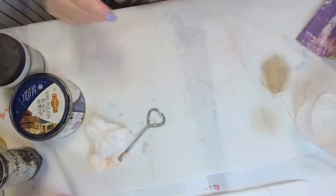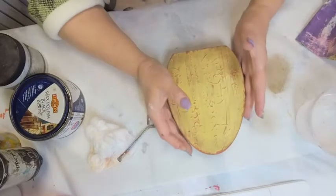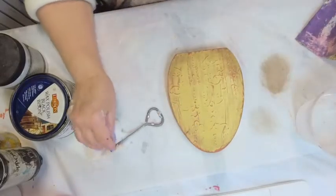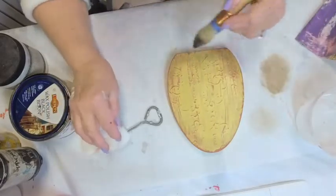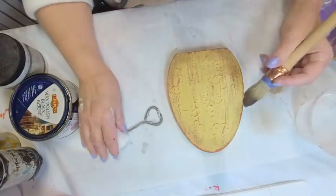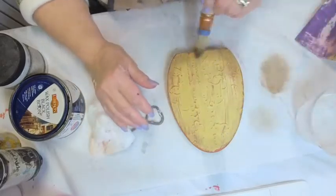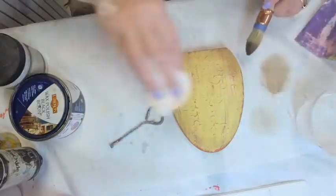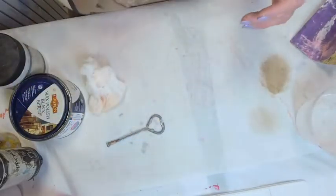You've now seen clear waxing and then a little dark wax to get some accents. That kind of waxing on a flat surface like a dresser: after you've clear waxed, take the dark wax and put it into the little crevices, then come and wipe it back before it hardens.